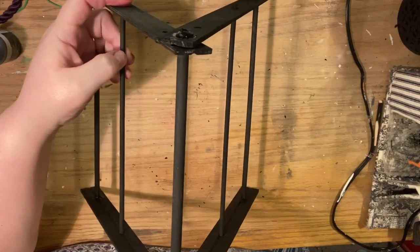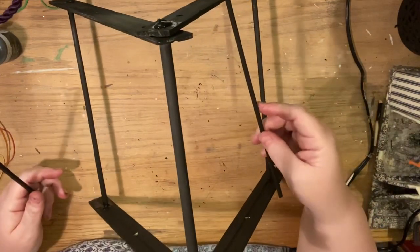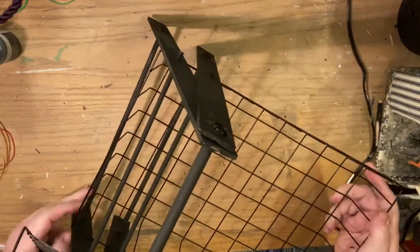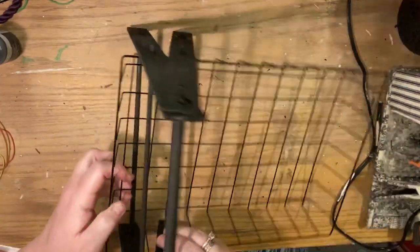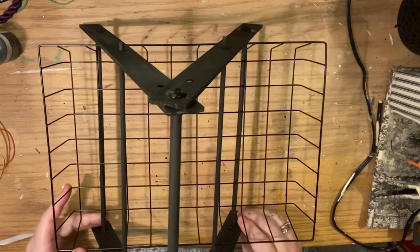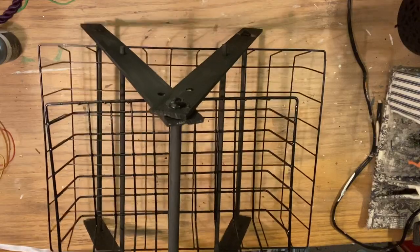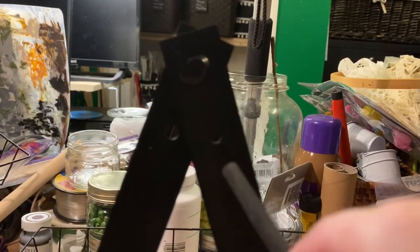Now we're just going to dry fit these dowels, and then we'll put the baskets in place. As I was mentioning before, the basket placement is adjustable. I've just decided in my mind that the second space on both ends is where I'm going to let my dowel go across, so it's even. Then you can adjust it accordingly. For future reference, don't put your top layer of removable dowels in before you put your bottom basket in, because you have to tilt it down. Remember I said you have to turn it in and lay it down flat so it fits nice and snug. So I will show you that these dowels fit perfectly in here.